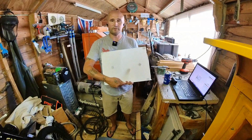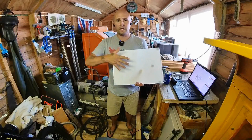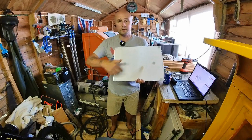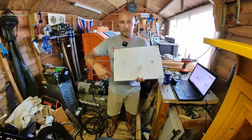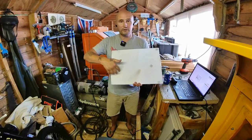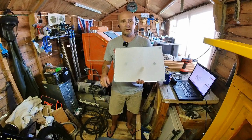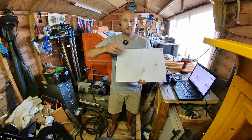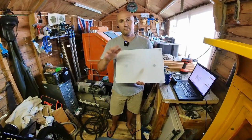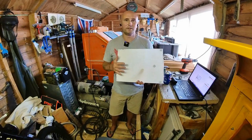Everything's set ready to etch the photo into this piece of glass. You'll notice my application tape doesn't go right up to the edge — I don't want to etch over the edges because in the past I've had glass crack where the laser touches the edge. Glass is much more fragile on the edge and I'd get a long way through and then get a split going up where the laser's just tapped in at the side. So I'm going to scale my piece so it's just within the bounds of the glass, put it on time-lapse again while it etches so you can see it, and then get it framed.